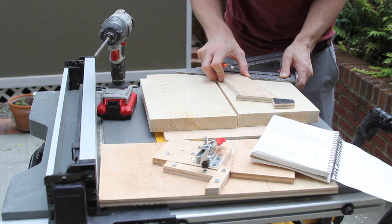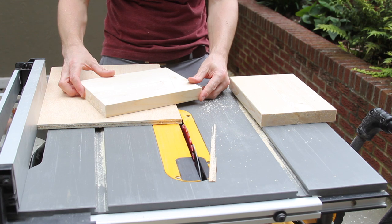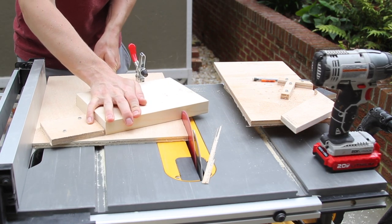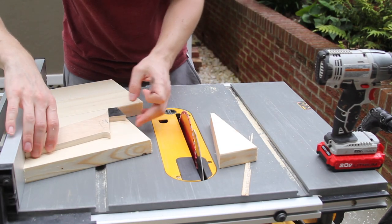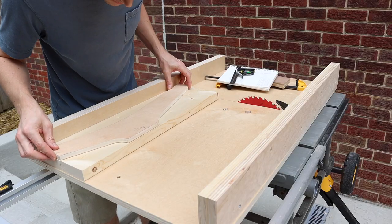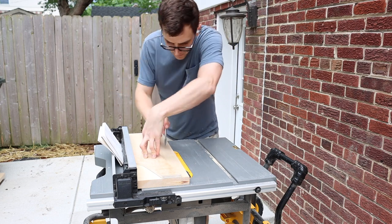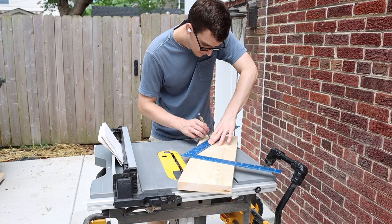Onto the feet — I played around a little to see what the best position for the grain would be, making sure the pieces had enough strength so nothing would just pull off. Then I used a line I'd made to set up a rough jig to repeat the cut for both pieces. I used that newly cut bottom as a reference to cut the tops parallel on the table saw. I'm attaching the leg pieces to the stretchers with mortise and tenon, so I left a little extra room for the tenon. I used my crosscut sled to trim the headboard support and foot piece to final length, traced out the template, marked a reference line parallel to the angle of the headboard, cut it with a simple jig, and I'll be using this angle as a reference for my router fence to cut the long dovetail.